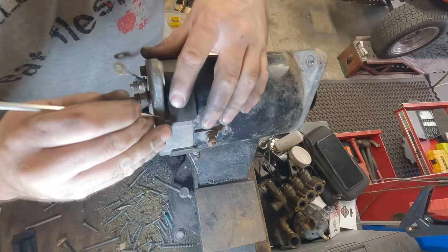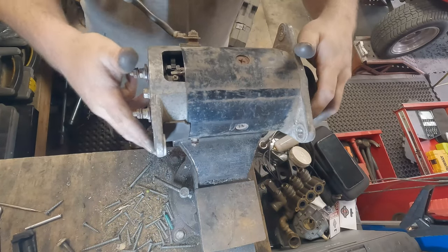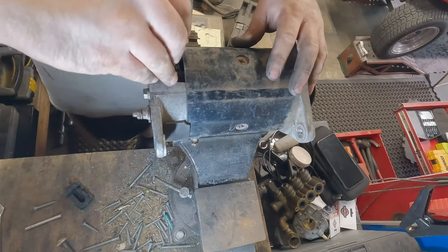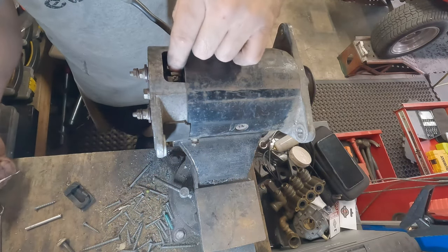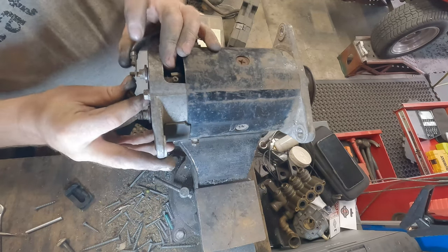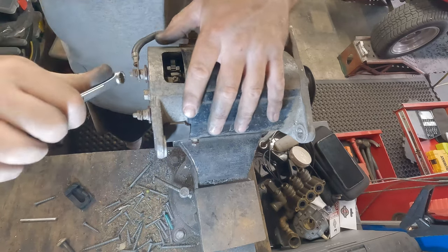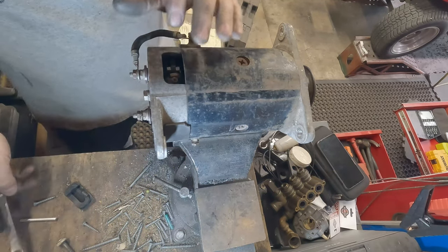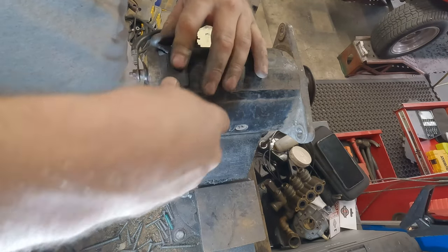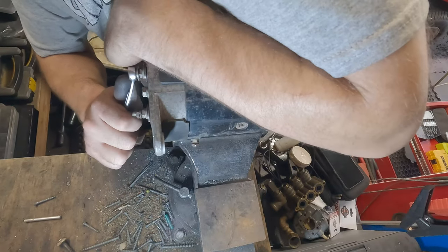The thin slot goes towards the metal case and the fat part goes towards the end cap. Make sure that your wire here doesn't short out against anything. Sometimes you've got to use a dental pick to get them to go in, especially these ones because they're really stiff. This wire here is touching the metal case — it's the A2 armature 2 wire — so if it wasn't the ground side it would arc and short out. Tighten this down too, shove this on — okay, all the caps are on.